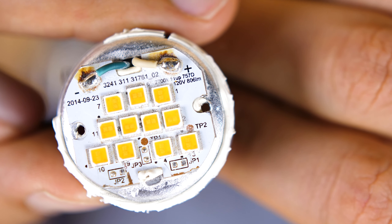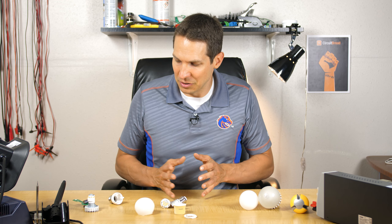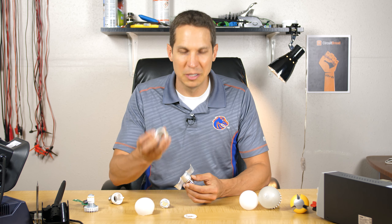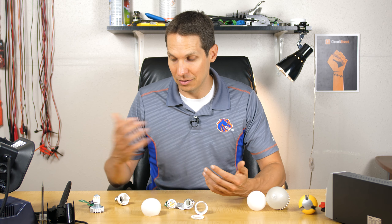This one was only rated for 10,000 hour life, and obviously I got a lot less out of it, probably due to overheating. The discoloration of the base makes me think it must have gotten quite hot. That's another interesting thing — on the Cree you have these big heavy metal heat sinks, whereas here you just had thin metal and a piece of plastic over it. That's all the heat management this bulb had. It's fun to see how manufacturers are dealing with mains voltage and heat in these bulbs, and how these clearly show how they fail at managing that heat.